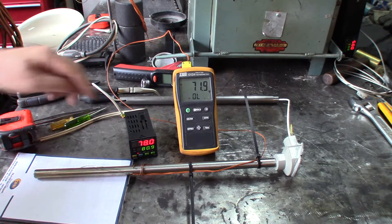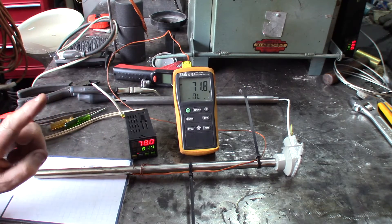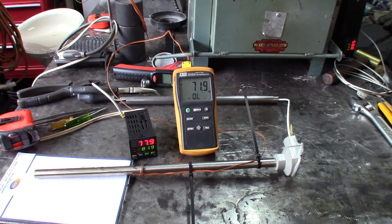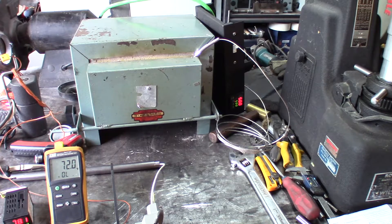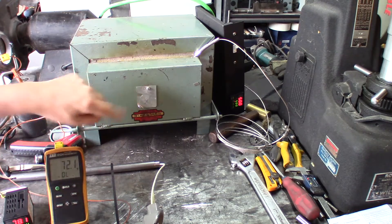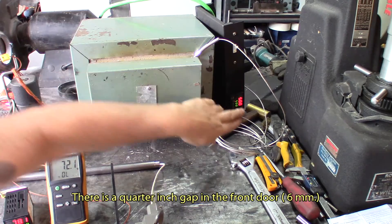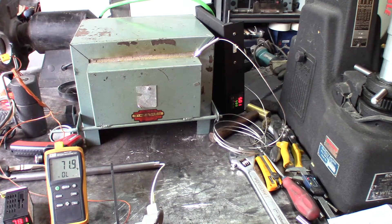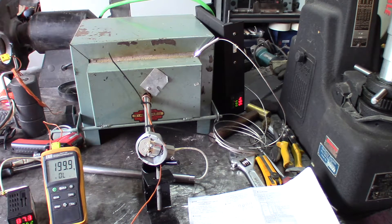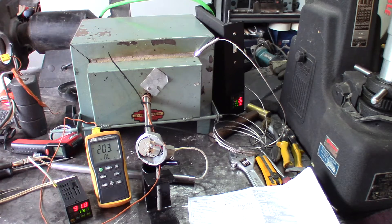So next, we know we've got a six-degree difference. We're going to send both probes into the little oven. The oven is set at 500 degrees Fahrenheit and it's been sitting there for a while, so the temperature inside is very stable. There might be some differences because of the placement — this one isn't in its normal place, it's just in the corner. We'll let it stabilize, because the bigger probe, since it's got a bigger mass, will take longer to equilibrate and get even with the other one.